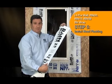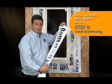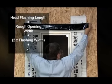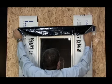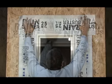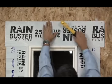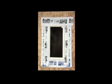In this final step we'll install the head flashing. We'll use RainBuster 415 25-mil in 9-inch width. Install membrane at the head of the window. Each end of the membrane should extend the width of the flashing plus one inch on each side of the rough opening. Adhere membrane over the window flange and jam flashing, flush with the top of the window. Using a j-roller, apply pressure and roll the entire surface of the membrane. Fasten with staples or nails along the top edge of the membrane using the minimum number of fasteners required to keep the flashing in place.